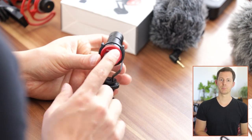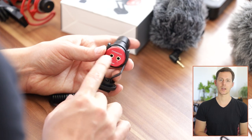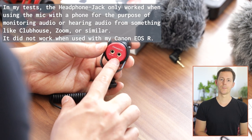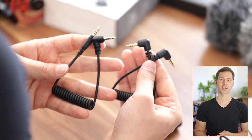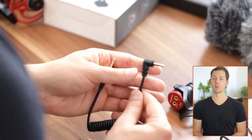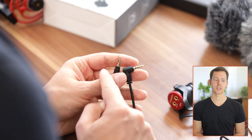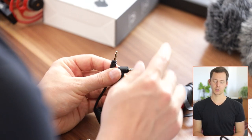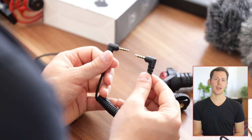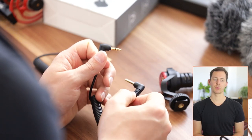One feature is very visible at the back — it actually provides two ports. The one on the left is a line out, essentially the mic out for sending the signal to your camera or recording device. The other one on the right is a headphone jack. Another really cool thing is that with the VCM5 you get two sets of cables so you can use this microphone with your smartphone or your DSLR. VK Mova chose a TRRS to TRRS cable for the smartphone connection, meaning the line out inside the microphone is a TRRS connection, and then a TRRS to TRS cable for connecting to a camera.